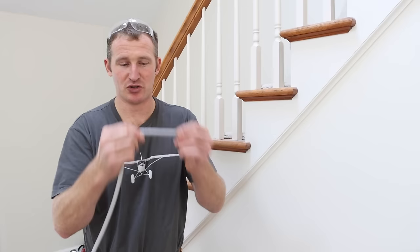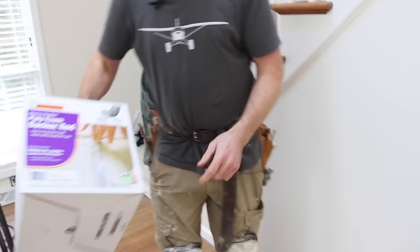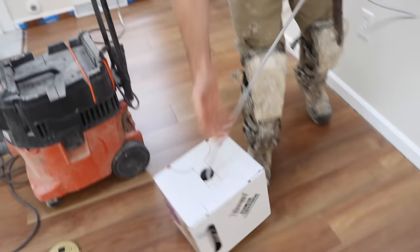And if you're remodeling, like most who are doing this type of project, you're doing other things within the home, and you want to make sure that you keep all the perimeter joints clear of any debris, drywall dust, anything that might get in the way of allowing this floor to expand. So using a backer rod will ensure that. This is a 3/8. It comes in a really large box, 350 feet of it. So typically this is great for larger rooms. You can get smaller quantities of this stuff, but again, really important to put this in your corners and keep that space maintained.